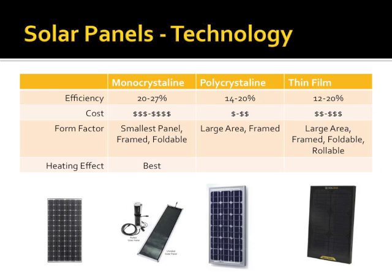Craig and I have done a few experiments before when I've dragged my big panels over to his place. The air temperature was, say, mid-80s, upper 80s, and just from being aimed at the sun and the fact they're black, the actual panel temperature was about 115. And at that point, your panels might only get a maximum of 70 or 80% of what they're rated at in the higher temperatures.